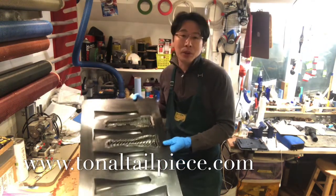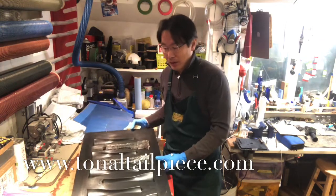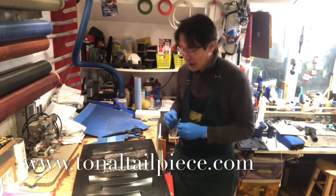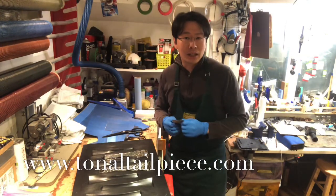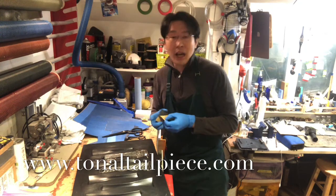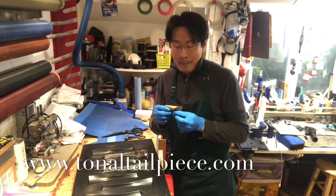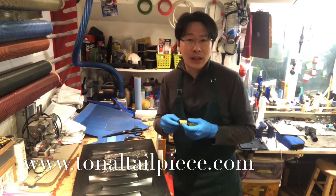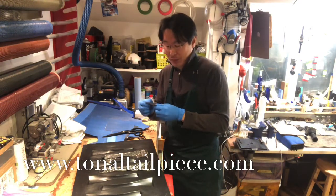As you can see, I'm using a mold here that we created out of carbon fiber, and each piece of carbon fiber that I'm laying in is pre-preg. Pre-preg is something that already has the resin infused into the fabric. They're basically like a very expensive sticker.